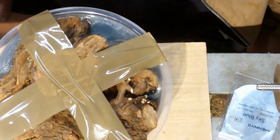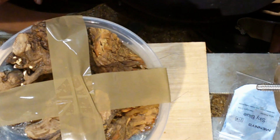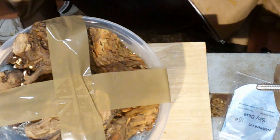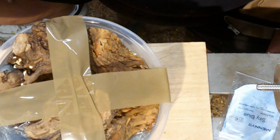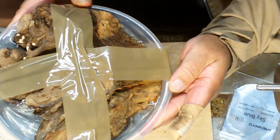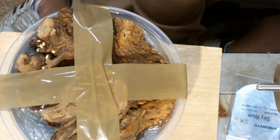The other thing somebody did suggest to me, which was a very good tip, and I can't remember who it is at the moment, but thank you very much for the advice. They said if you take the wood and coat it with resin beforehand, it seals the wood and stops any air bubbles coming out of the wood at a later date, which I thought was very good advice, so thank you for that. I'm sorry I can't remember your name. So in the end I mixed up 2 lots of 100 grams and then 50 grams, and it was just enough to fill that pot up.